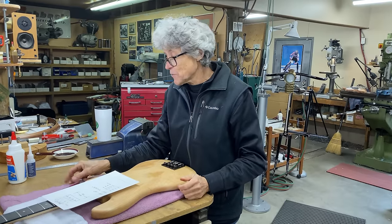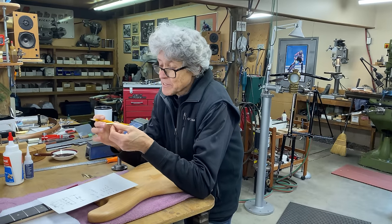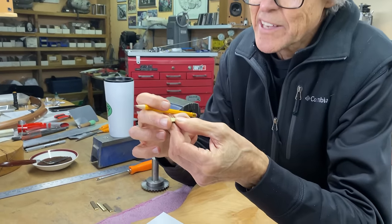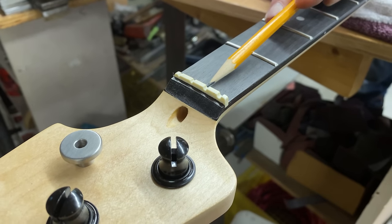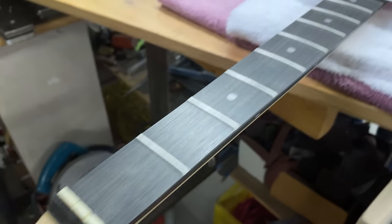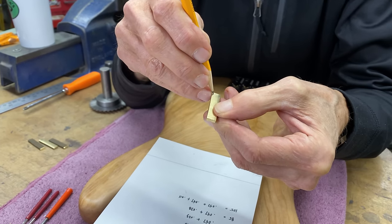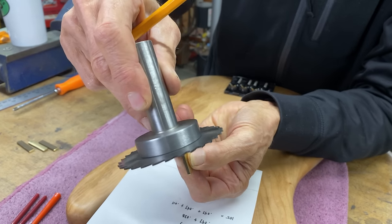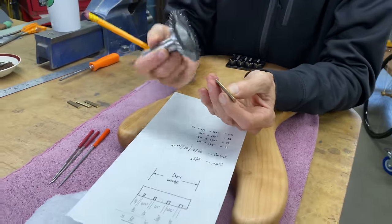And then at 5 o'clock in the morning, I'm thinking, no, that's not the best way to do it. What I need to do is hold it in the vise lightly, at an angle, maybe a 10 degree angle, because these are all at an angle, because you don't want the string hitting in the middle. You want the string to hit at the very edge here. That's why it's at an angle. And then I drill 4 different holes at an angle. So I've got the radius already. That's when I move it to the side and come in and match up the hole with the edge of the cutter, to within a couple thou. So that's my new plan.